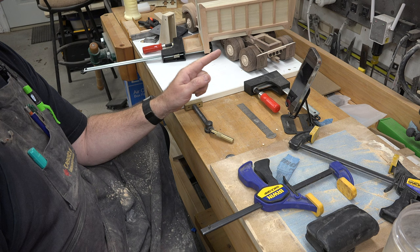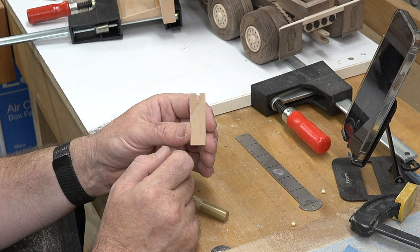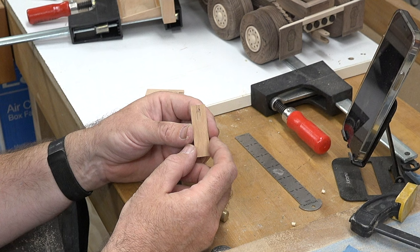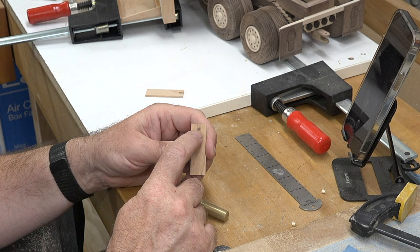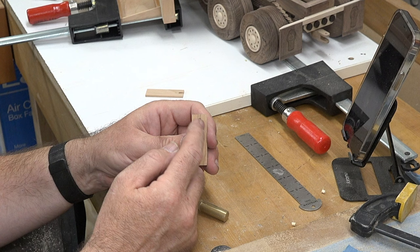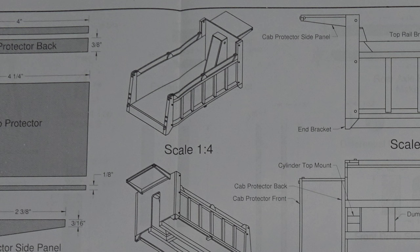Now guys, here is one finished and it looks perfect as far as the hole and the lines go to get the groove that's in the top. Truth be told, this was done at the drill press and the scroll saw. So we've just cut our piece to its proper dimension according to the prints, marked where the hole would go so that the edge of that 1/8 diameter hole is down 1/4 inch from the top. So the center point is actually down 3/16 inch. We've drilled that hole and then taken it over to the scroll saw and treated it like an interior cut, and then just followed through with the lines to make the slot. And after some sanding, you end up with this. So we're just gonna get these glued into our dump box. They just go at the very top end of our front trim pieces.